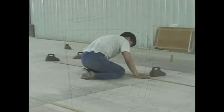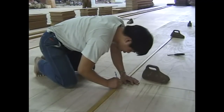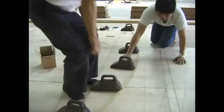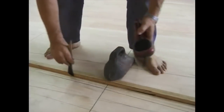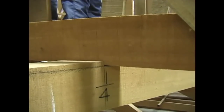The architect's hull lines are drawn out full size on the loft floor, where they are carefully checked for fairness using wood battens. They are then used for making frames which are placed on a jig with great accuracy.